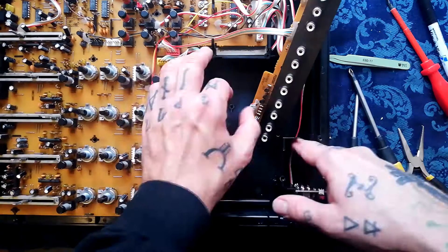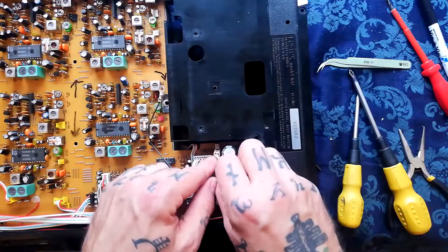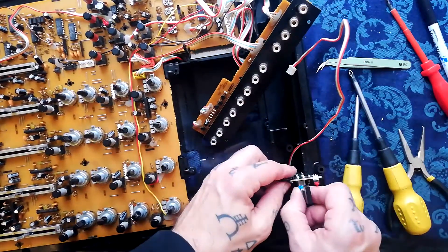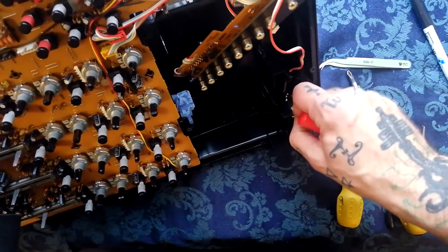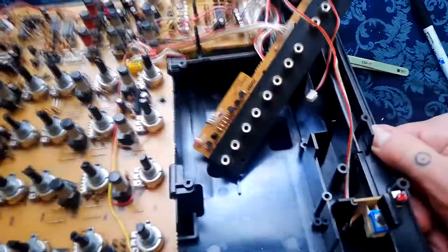The power switch here has a red and white cable running off it, passing through this gap in here. I've already taken it out but it goes into this header here just beside the largest capacitor on the other side. I'll pull that out — it's just slotted in here, quite tight. I have removed this from other ones but I don't want to force it unnecessarily. Maybe there's a little bit of adhesive in this one which there wasn't in the others. You've got quite clear access here to the underside if you needed to do any desoldering, so perhaps I'll leave that one.